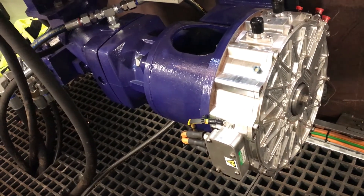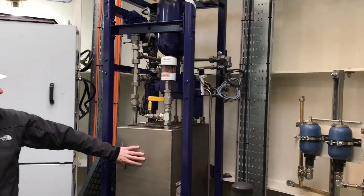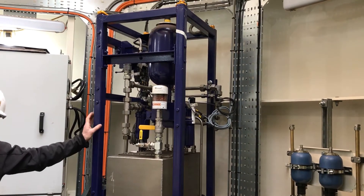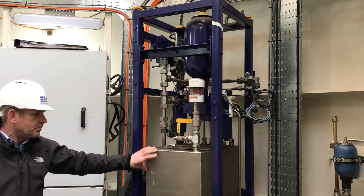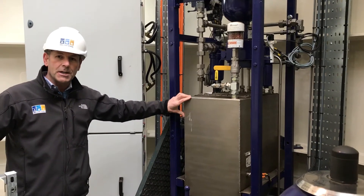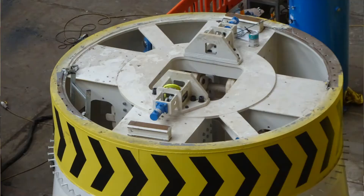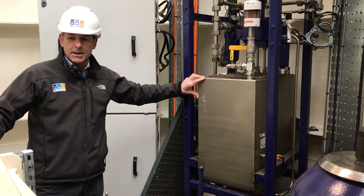Round to my left here is the hydraulic power unit — we've got an oil reservoir, accumulators, and various valves. This has two functions: one is to provide a reservoir of oil for flushing the power take-off system, and the other is to provide auxiliary oil for operating the floater brakes, the locking pins on the floater, and the brake on the winch.